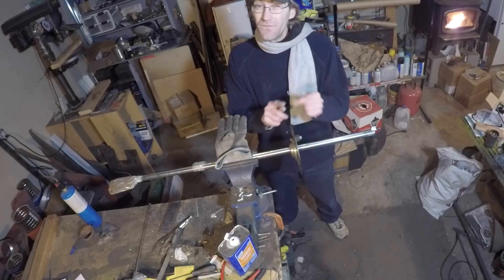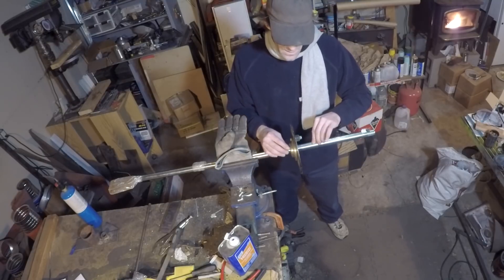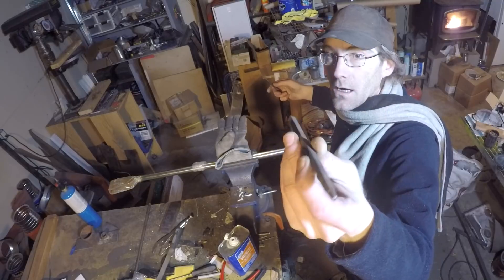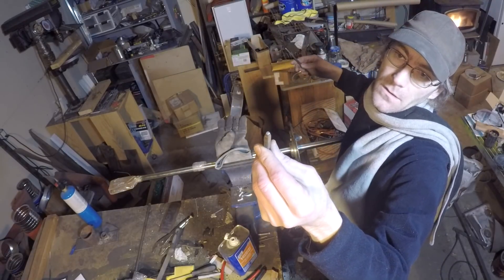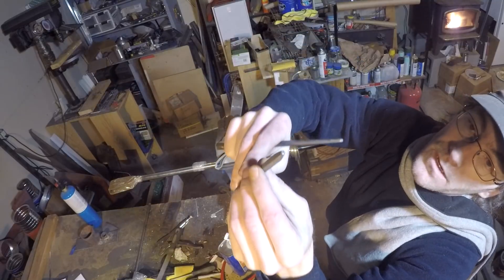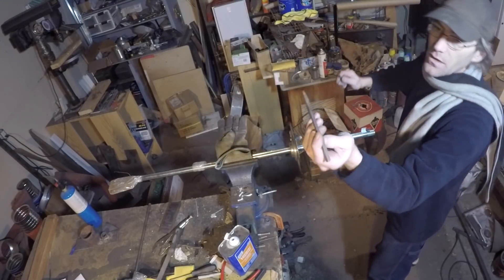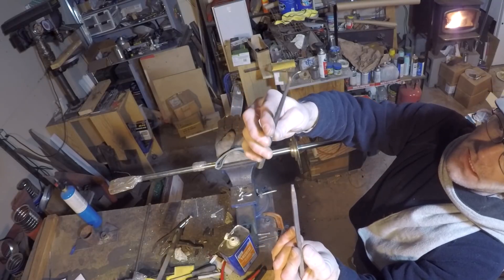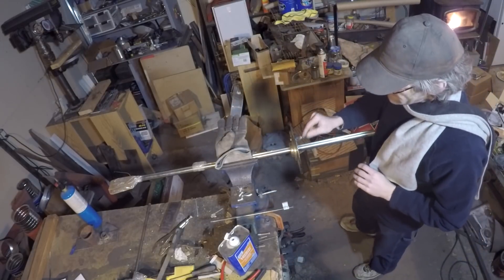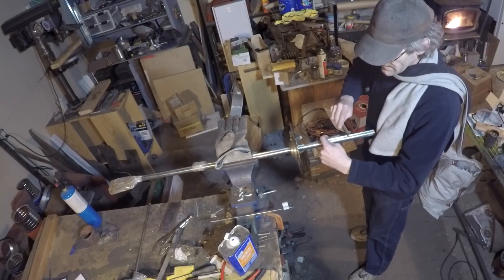You could also put a little bit of oil on the key stock before sliding it in. You can also make yourself a small punch from quarter-inch square solid rod, ground to a blunt point, so if you have a small piece to tap in it will fit right down in there. Here's one I made and one I bought — they're simple little punches. When tapping key stock in, don't hit it at an angle; lay it down as flat as you can and then tap the key in.